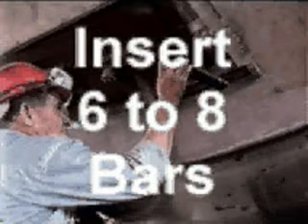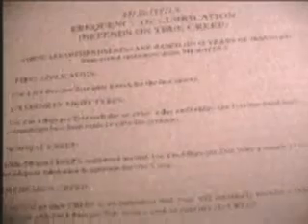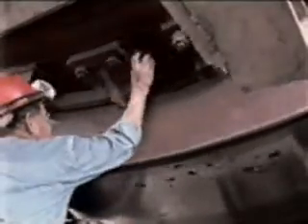If you have never used lubrication before, apply six to eight bars per tire per week for one month. After, apply four to six bars twice a month per tire. Refer to the application chart on the box for more precise application instructions if you have excessive creep readings. Be sure to leave about one inch of the lubrication bar hanging out of the front side of the tire. This will ensure proper lubrication of the stop blocks.